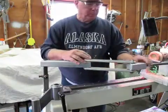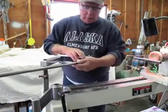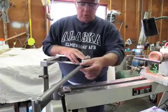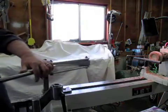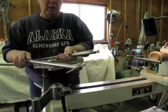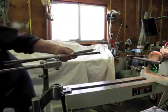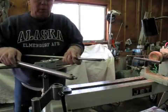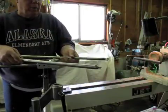This block right here is where the tool is actually inserted, and you can see some little set screws here where it is tightened down. This particular block is drilled out for a three-quarter inch rod. I have several of these tools — I'll show them to you in turn — that I developed for another boring system and I homemade these. Here's a cutting tool that's meant to be inserted into a deep hollow form and cut away the walls. This is a straight boring tool, typically used when you make the initial plunges into the workpiece to create the start of the hollow form.